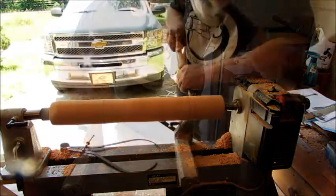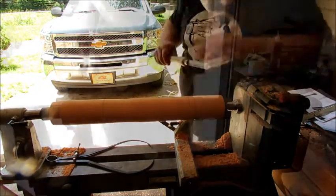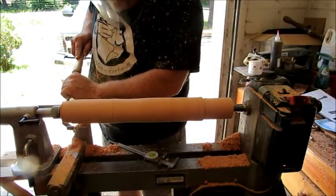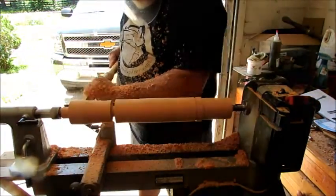Now I'm using my parting tool and my calipers at each of the reference points to take each different section to the proper depth. I started turning the ends down, the one end where the 3 feet will go, and then the tenon for the top where it will go into the brace that connects it to the top of the table.